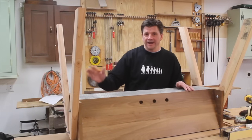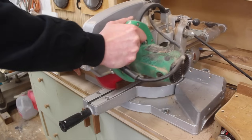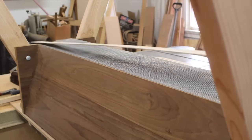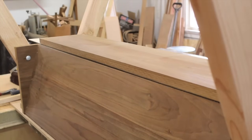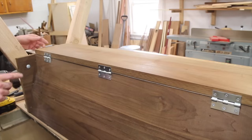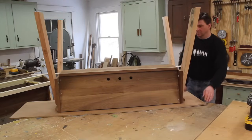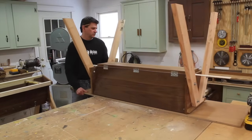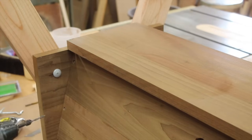The next step is to attach the door. You'll get the door out of a one-by-eight — just cut a piece at 42 inches and attach it to the back of the hive with three hinges. I'm using a piece of 1/8-inch plywood as a shim to add a little ventilation when the door is closed, and once the door is attached I'll remove the plywood. I placed the hinges 4 inches in from the ends and one at the center. Then I'll spin the hive around and add gate hooks 8 inches in from the side to keep the door closed during winter.